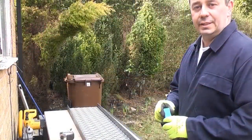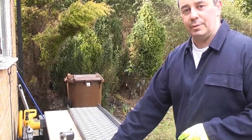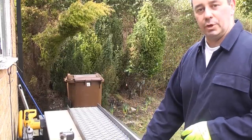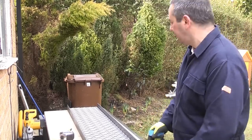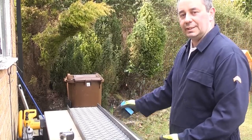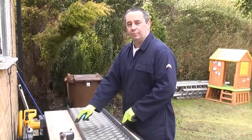It's a fine day today so we're going to make these ramps outside. Basically the ramps are made from some 50mm angle iron at each side and in between we've got a piece of aluminium checker plate which is about 5 or 6mm. I've already cut this material to length so it's the correct length for the ramps.